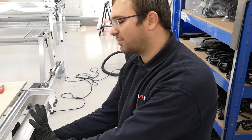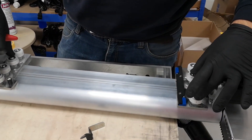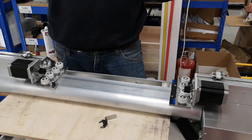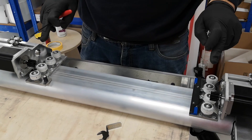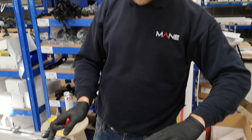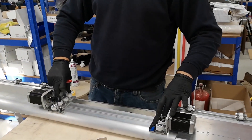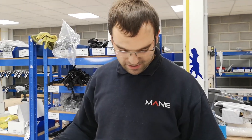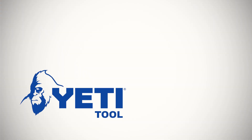So this is pretty much the whole procedure. You only initially adjust preload on the first and third wheels — those four wheels — because then it's easier to get the squareness, instead of trying to do it with all wheels at once. You can adjust squareness from the back wheels, front wheels, or a combination. After you're happy with the squareness, lock them down, then adjust the remaining four wheels to that. For tiny differences, use the rear wheels to put a bit more load to one side or the other, and that will square it perfectly. Thank you.